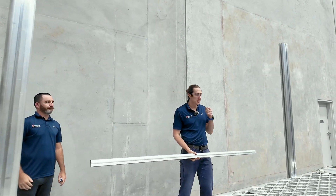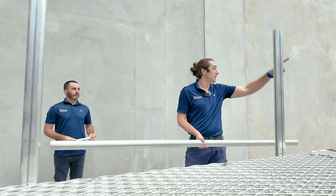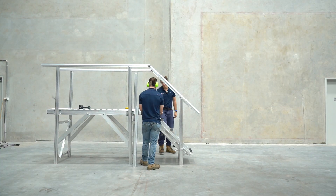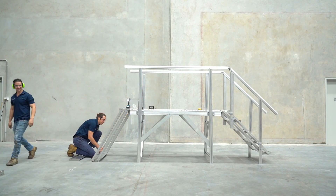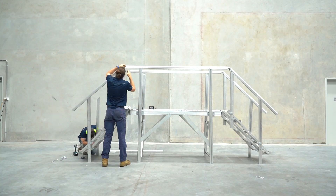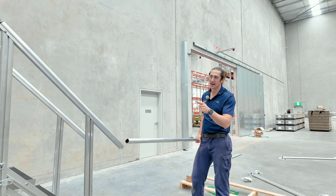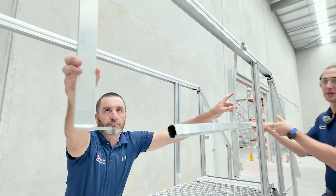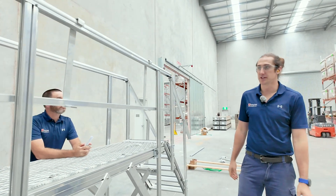The next part is to put the handrails on so that we can line up the second stair support post with the handrails. We get the handrails on top, line them up with the top handrail rail coming up the staircase. Then we put the knee rails in place and line them up with the handrails down the staircase — slide them in behind the post and place them on the knee rail spacer tools so we can screw them into the post nice and easy.